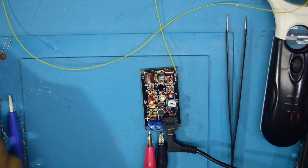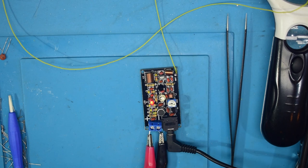It's quite a low power transmitter. I did have my big test set on there, and it seems to be putting out 10 milliwatts of RF, which is actually quite a lot, considering that for not much more of that, you can get some quite good distances with RF. But in this case, how accurate that is and how wide a spectrum that is, I wouldn't like to say. But generally speaking, it's not designed for great distances. Probably just to retransmit your phone to an FM radio so that you can listen to it on a louder system, broadcast it to your own stereo, that sort of thing.